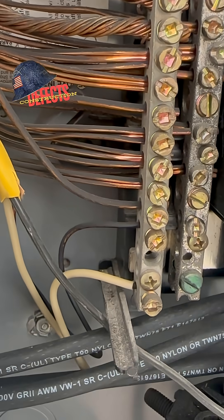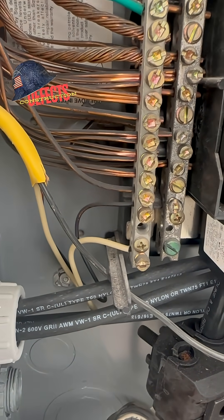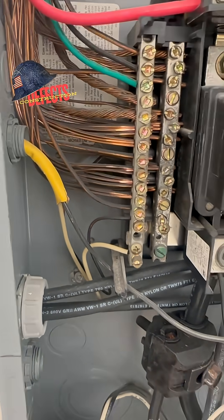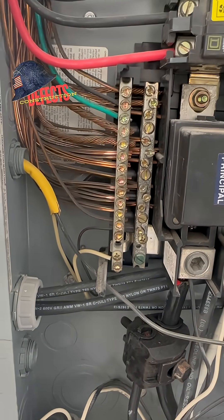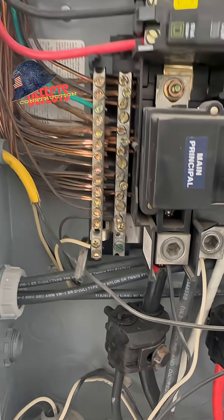The recommendation is going to be to consult with an electrician. An electrician needs to check the ohms on the ground. The ground outside is like super marshy. A lot of times in this community, I've seen them do a delta ground to get a better ground — that's where you use three ground rods.